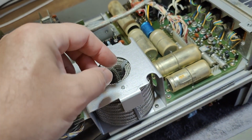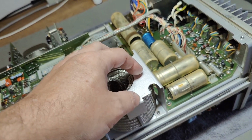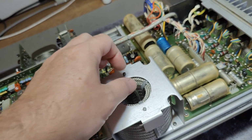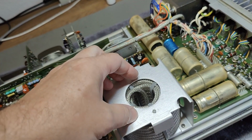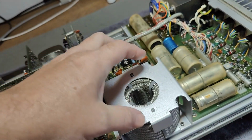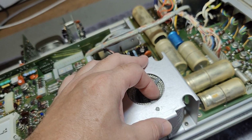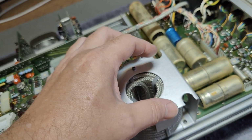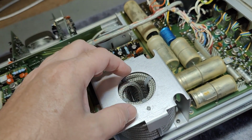And also this is a balanced delay line, obviously, and depending on the different design in those delay lines, this could explain why this one is so long. So if it's not a coiled design, but a straight design of the two balanced wires that goes through this, then it could explain why they made it so long. Obviously, I would expect the coiled design will require a much shorter length, but it's also very difficult to make it super good.